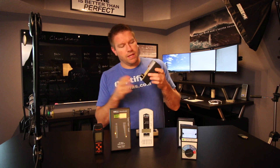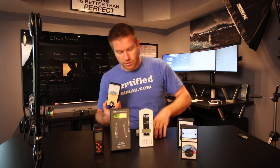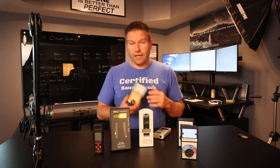The way you can still use these budget meters is: once you figure out what the sources are — say you had wireless wifi baby monitors attached to the arm of the crib so they're close to the child's head — you didn't realize that within 12 inches of that, the RF emissions are going to be just like a wifi router cut in half, which are pretty strong for a child. What you could do with one of these meters is get right on top of the source, measure the levels, and then deploy whatever mitigation technique you're going to use — like an EMF blanket for the baby or removing the source. You can AB test it, but for determining an accurate level or accurate reduction, I wouldn't bet my life on anything like this.